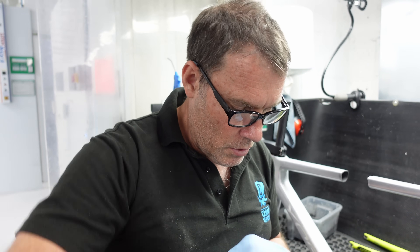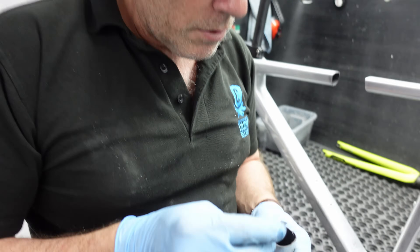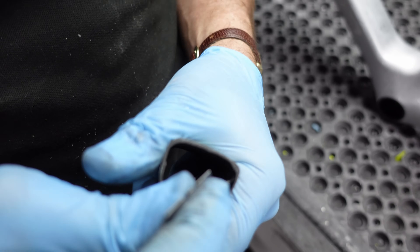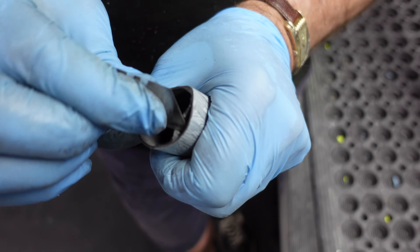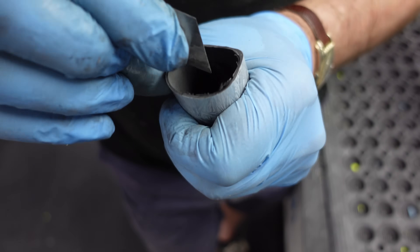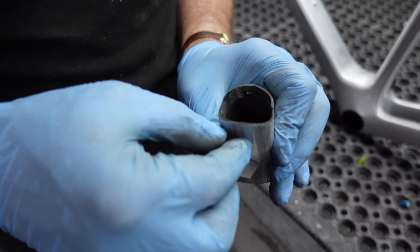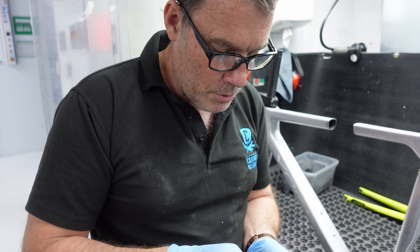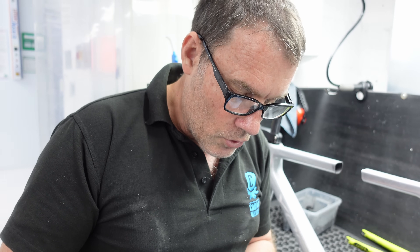Can you imagine a bike like this dealing with thinner wall thicknesses when you find air bubbles like this — which you won't see on a Specialized, a Trek, or a Pinarello? You won't see these internal blisters. So I'm not sure if they do any inspection. You can also see how dry this is — I can just pull this away and peel it off. It's very dry. The inside walls are very clean, but maybe they could compress a little bit more. Remember, the radiuses are always the areas on a bike that suffer the most when it comes to keeping that compression up.